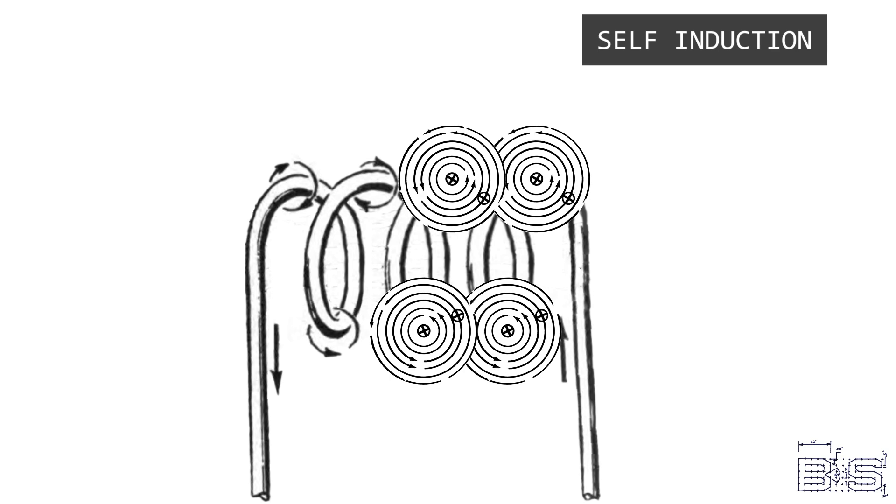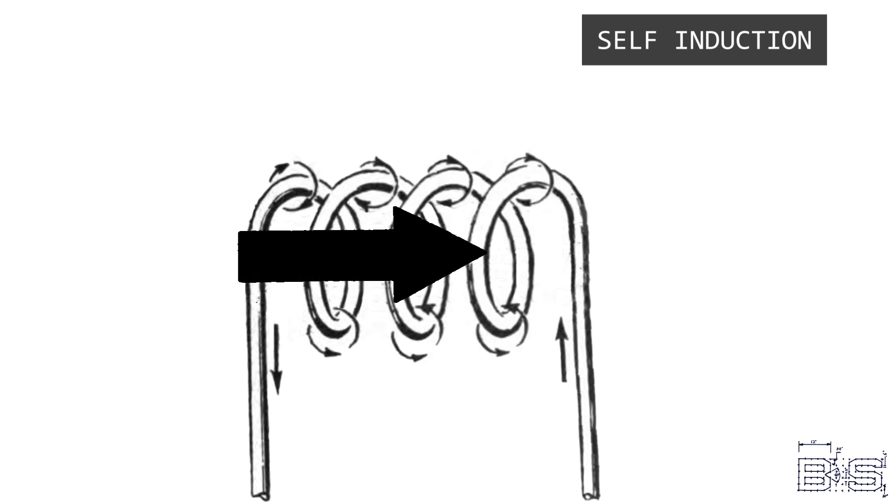But how does this work? There are no resistors in there, because if I put DC through an autotransformer it's a dead short across everything. So induction has to play a role somewhere. If you remember some of the properties of a coil: when we first put voltage through it, there's a voltage drop across the coil because of self-inductance. The magnetic fields of the coils interact with each other to induce a voltage drop, impeding that voltage's ability to increase. And that's how a step-down autotransformer works.